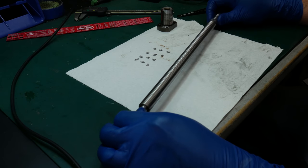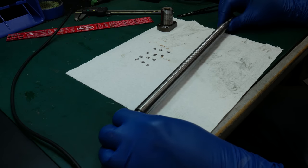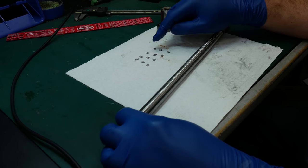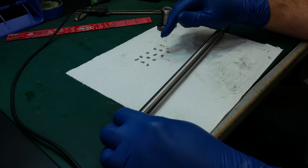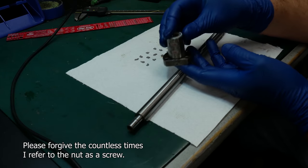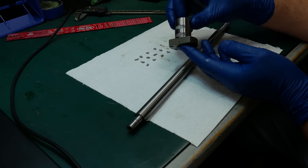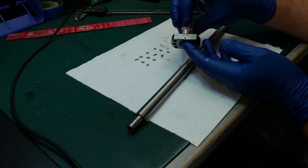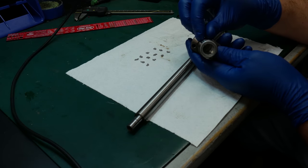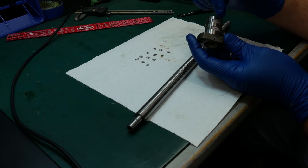So what have we learned here? Well, we knew that this was a 16 millimeter ball screw, and after careful counting, there's actually 116 balls, which actually works out to be a good number, because if we look at this ball screw, it has four separate recirculation points. So as the thread makes its way around the inside of the screw,